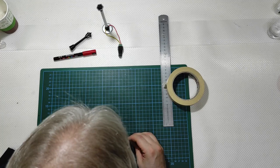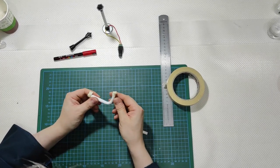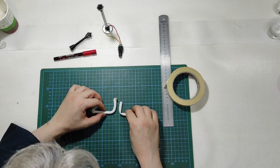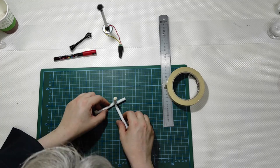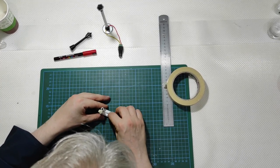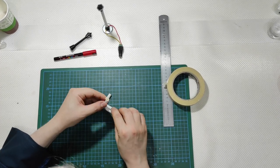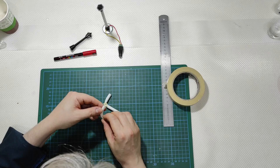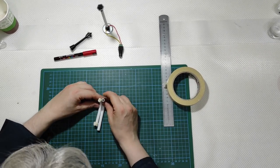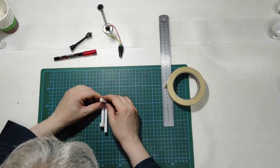Identical angle, guys. Okay? But with way less deformation. You can see the difference, guys, there. Okay? I went 90 degrees once again with a more regular shape, a curved section and a curved section. Yes, 70. But the sand inside gives stability to the shape of the pipe.